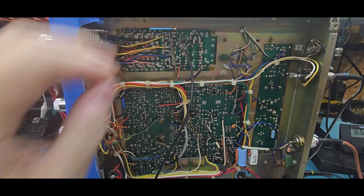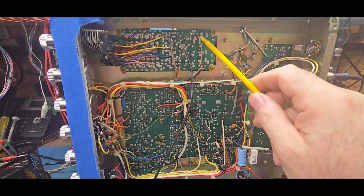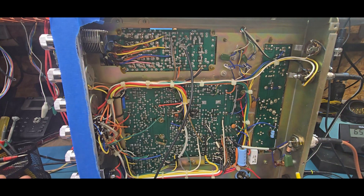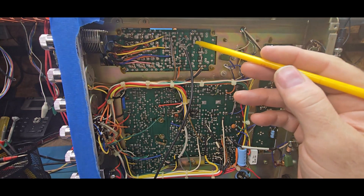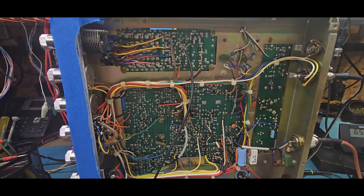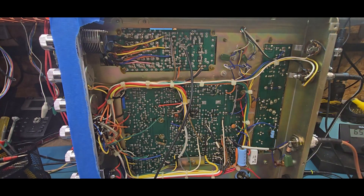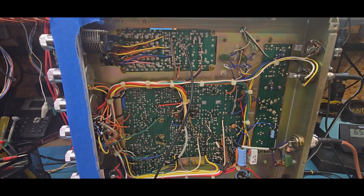Take your cap and try it here first. Look how your receiver responds. If you don't like that, try it on the other side of the transistor — maybe you're swamping that transistor a little bit. What I do is get the scope, look at these points, and say okay — what matches best to the output of the DDS — and I get it close enough and it just works right off. That's all there is to it. Get the frequency, inject it, make sure it works. Then you can do the simple stuff like heat up your hot glue gun and put your display in, bolt on your encoder — same thing.